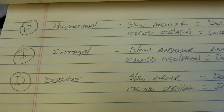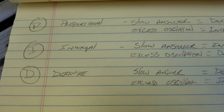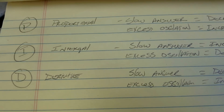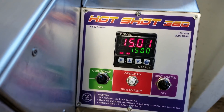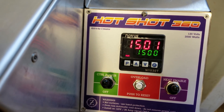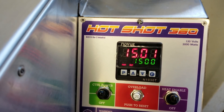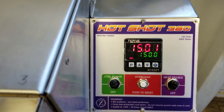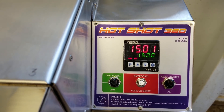On the downswing it does the same thing — if it sees the oven dropping off too quickly, it's going to compensate by giving some output to maintain the temperature. Now, if this oven's intended use was only 400 degrees, these PID settings wouldn't be very good — we'd probably get a lot of oscillation at 400 degrees, so we'd want to auto-tune it at 400 degrees. A lot of people don't really understand what PID means — I hope that helped clear things up. Thanks for watching.